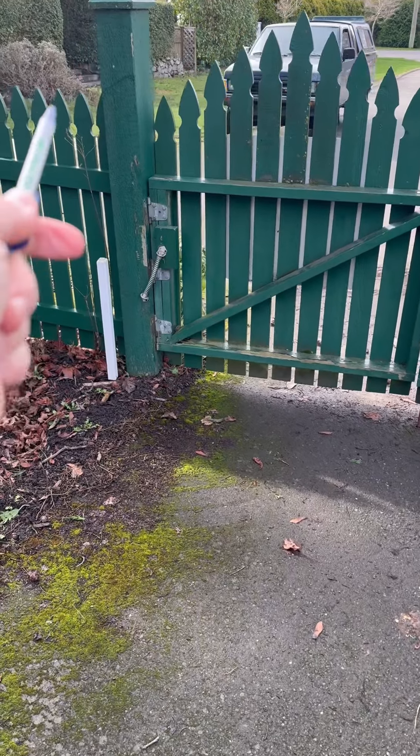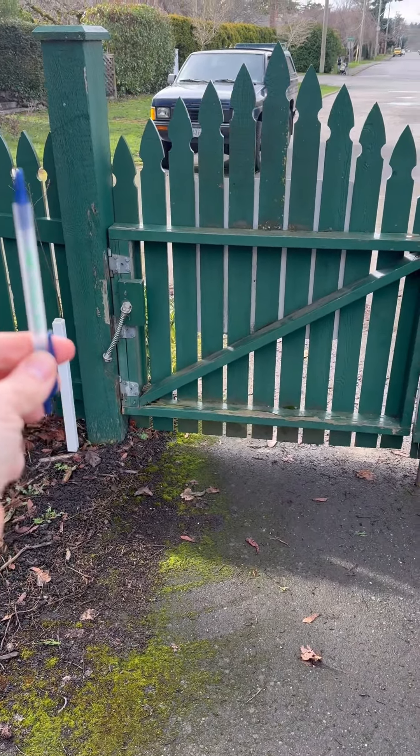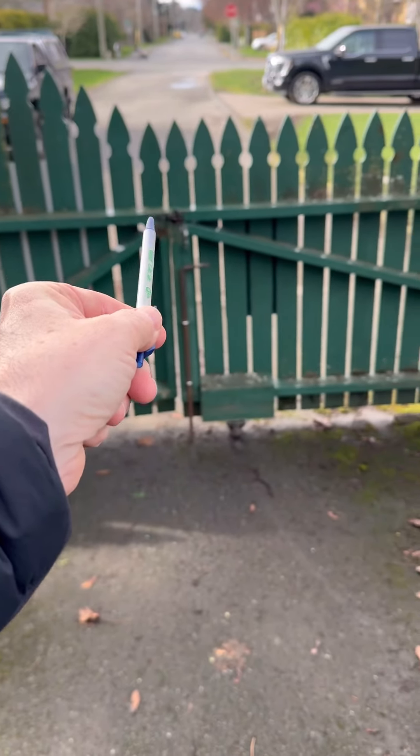From our side of the fence you can see the six by six is cracked. The attachment for the gate is compromised, which allows the gate to sag, making the connection point between the two pieces of gate tight and causing it to bind.